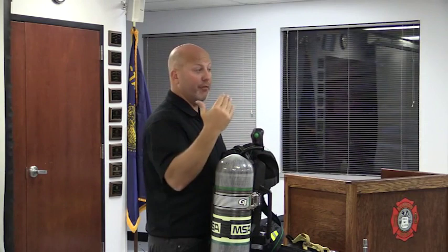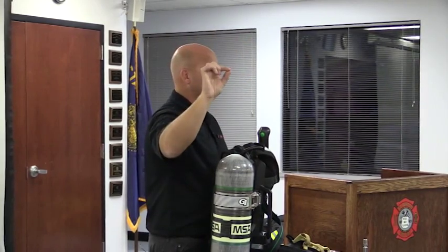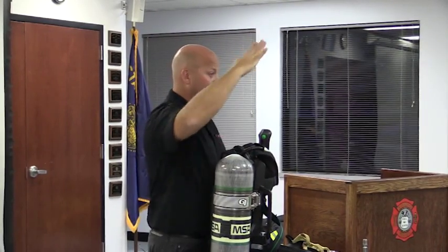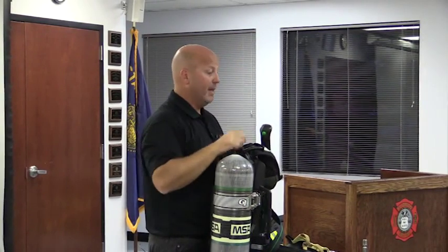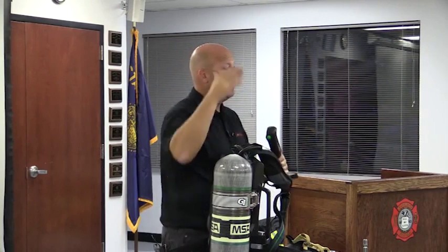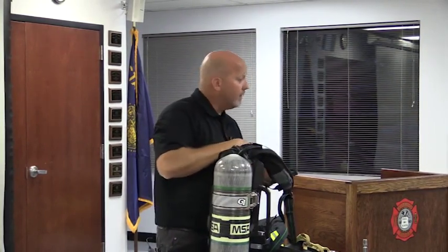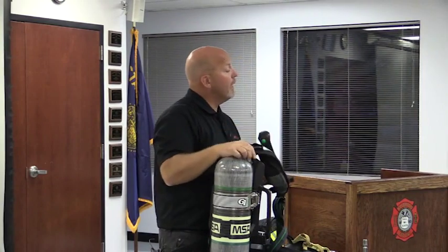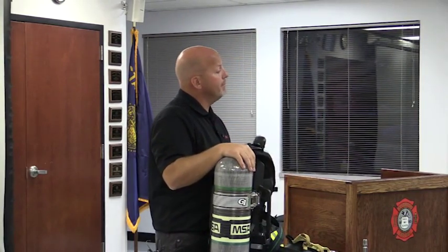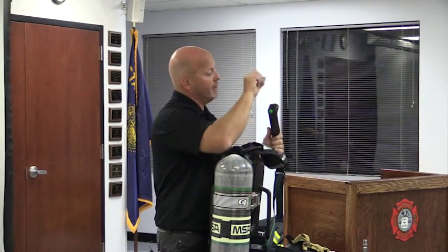It's based on Project Fires, which was a study of core temperatures, of internal temperatures of the body. 600 degrees for approximately 2 minutes, 200 degrees for approximately 22 minutes. If you break that curve, it sounds the alarm. Nothing needs to be replaced, you just need to drop below that time heat duration. Same thing you have on your current breathing apparatus. What's that? A two-tone beep every 3 seconds. Beep, beep. Beep, beep, and then you also get an icon of a thermometer flashing on your screen.